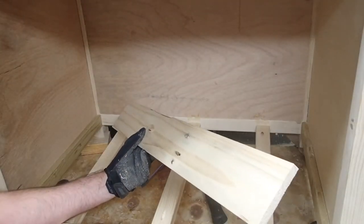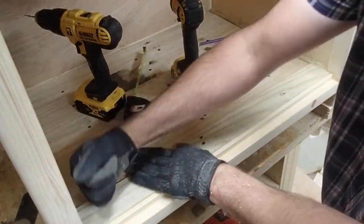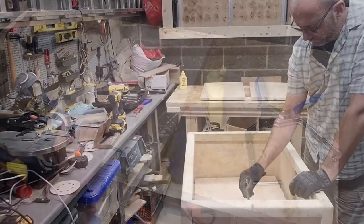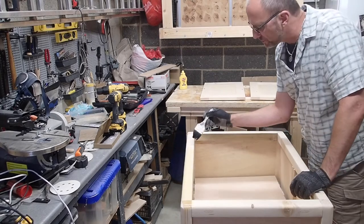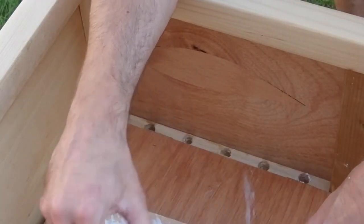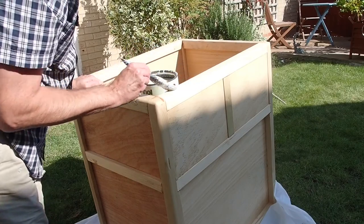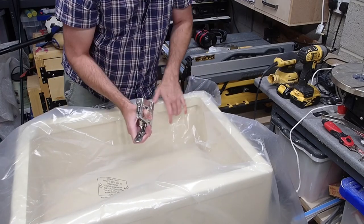For the base shelving, I just have a few pieces of pallet wood that I've had trimmed up. Then two coats of wood preserver according to manufacturer's details, and let it dry for 16 hours before you add the paint. After the wood preserver's dried, I'm just using a couple inches worth of PVC, rolling it in some adhesive, and placing it in the hole. Then a bit of paint, attach the latch, and then for the liner I just have some plastic sheeting that came off of a mattress. I want to staple it to the bottom of the rail here, and then trim it off later.